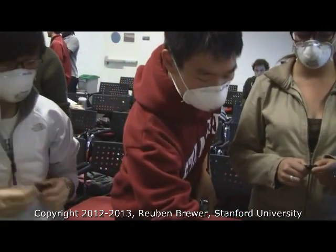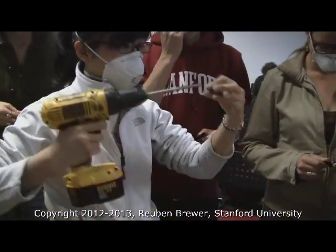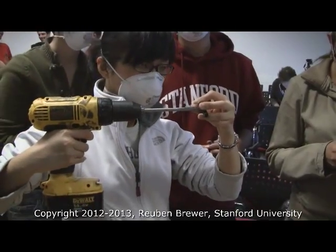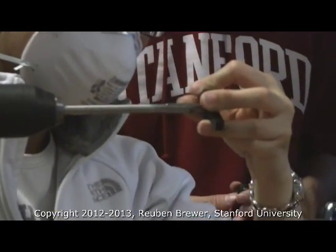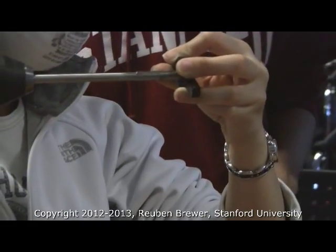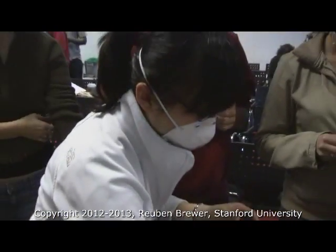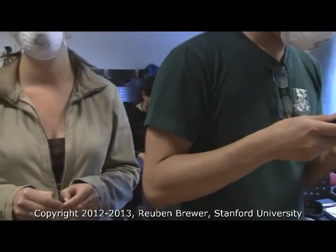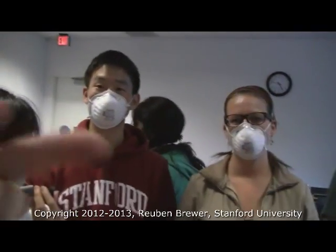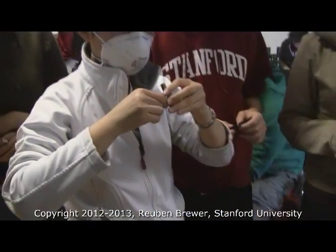Go until you've got about four threads left then reverse. Go ahead and reverse. Remember 90 degrees — I should have said good job, but remember 90 degrees. Try not to stop the drill when pulling out. Now try fitting in this shaft. What happens if you stop the drill — these orthogonal cutting surfaces will make a cut into the surface and burr. You've got a little burr on the inside on the axis. See? What a nice fit. You reamed it.